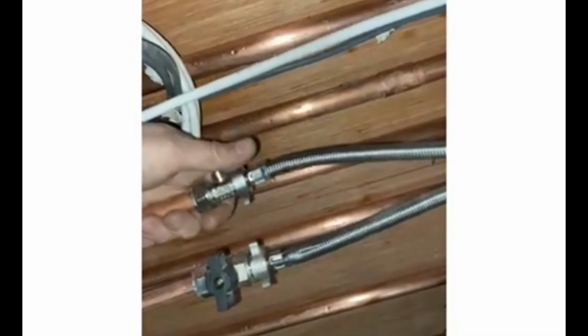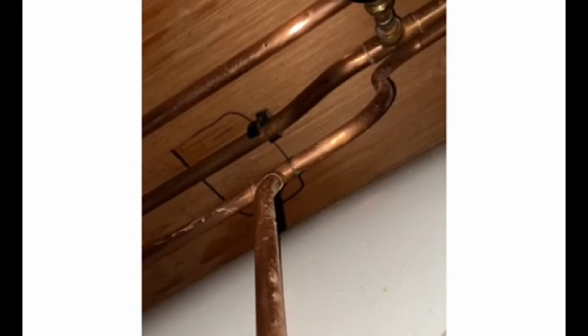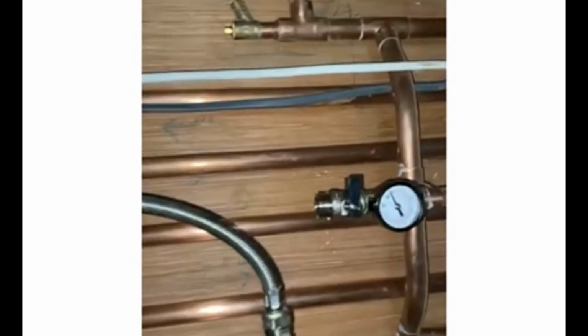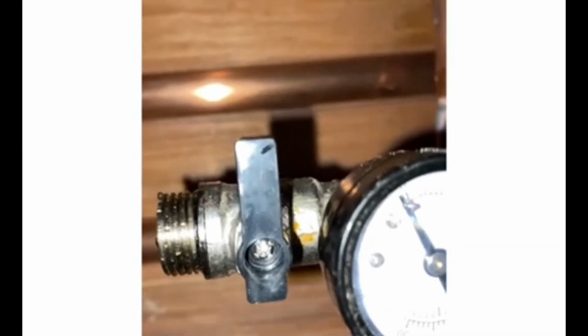So you then isolate. Here you've got 6 bar on your pressure gauge up there. It's probably a bit small, this pressure gauge, to do this test. But that was the one supplied with my Robo kit. You then isolate the heating off and then you depressurise your pump. And detach. So that is now sitting, and if that gauge drops, then I know I've got a problem.